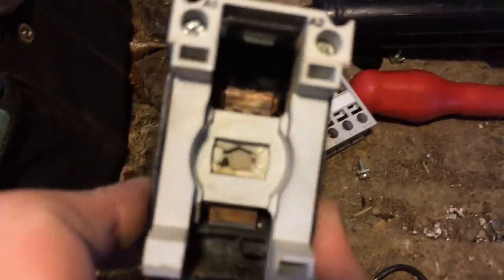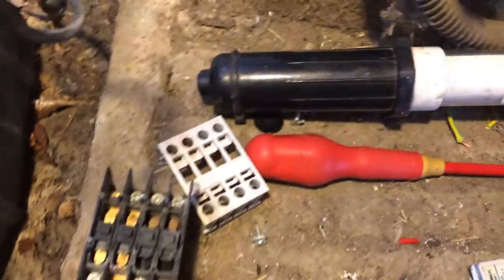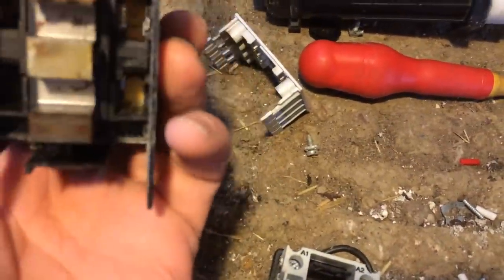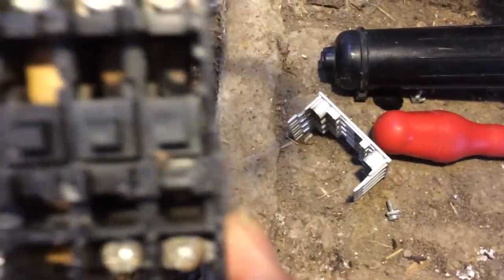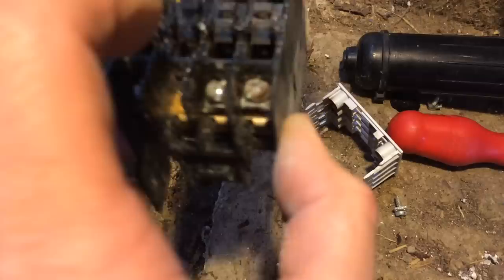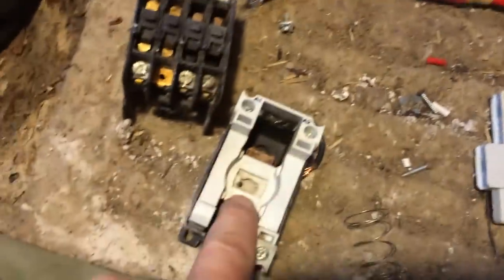You can see the coil's burnt out in the centre there — it's all melted. That's why we couldn't push that in. That square block needs to go down. I took the cover off and you can see there's two terminals in there — pretty burnt. So I think this has burnt out and stuck. It's not been able to pull in and the coil's burnt out.